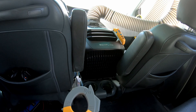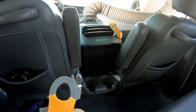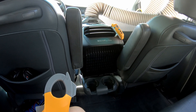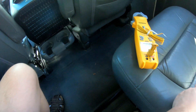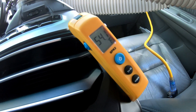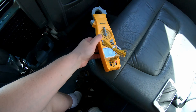The other thing we're going to test: some people have said you actually get colder output air by lowering the fan speed. So we're going to knock it down from max to medium and see if that makes any difference. We're almost at 25 minutes running now. At the moment we have 54.1 degree supply air. Right where the unit has been sitting we're reading 79.8 to 80 degrees.